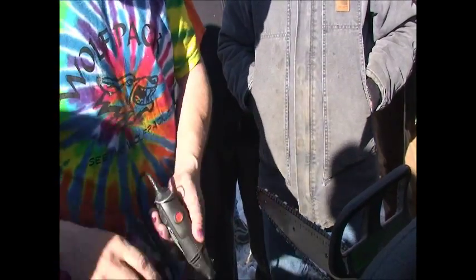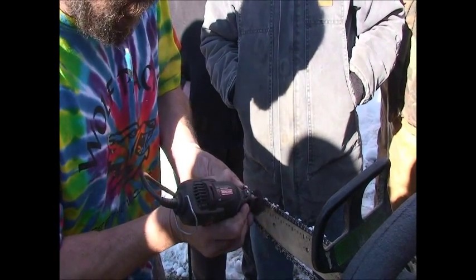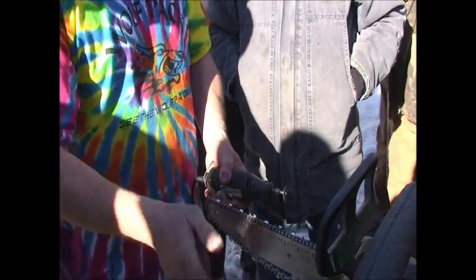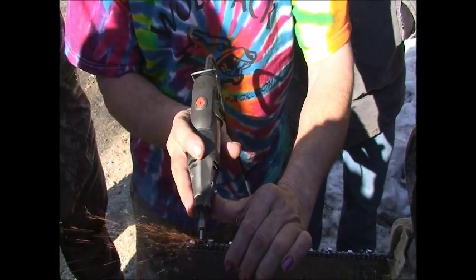So when I go through the saw, I'll go this way and that on both sides of that raker. Not getting carried away, just a little bit exposes more of the side of that tooth to the saw kerf, and it'll make it turn corners way better.